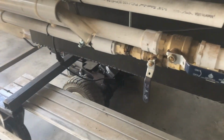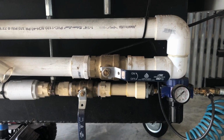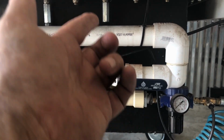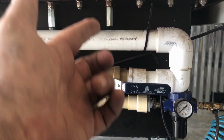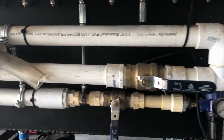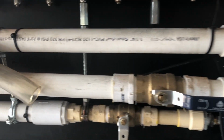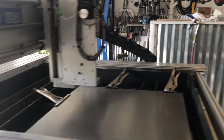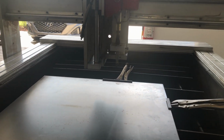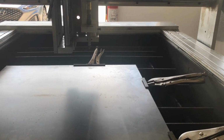And then you come around to the side and it kind of works like a fountain at Disney. You put air pressure into the bottom tank, and then that pushes the water up into the top tank. You let the water out, you let the air out of the bottom tank, and the water comes back down into the bottom tank, and it drains and fills with the same reservoir, because I don't have direct access to water in the garage, so it makes it easy for me to keep the tank full, and it also keeps the dust and grit down to almost nothing.